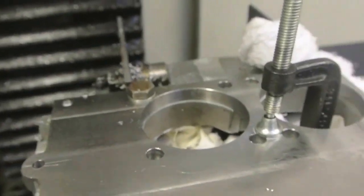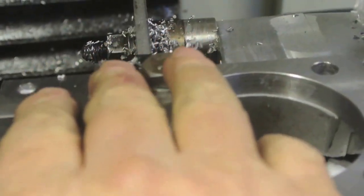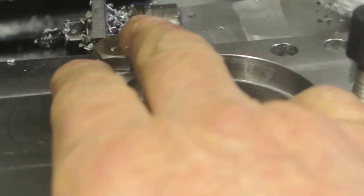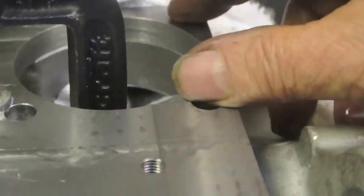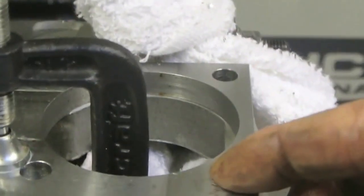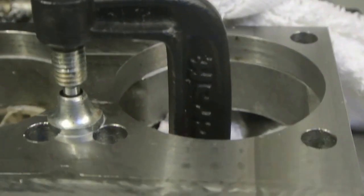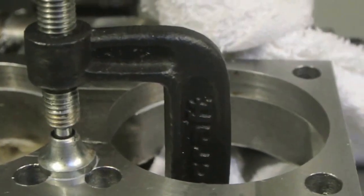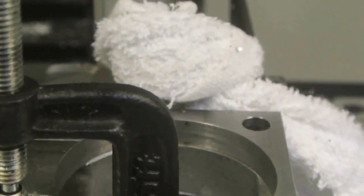Now you can see I've fitted a bolt in this hole here, tapped it while it was in the machine and made a bolt to fit. Next I'll run up this row of holes — I'll do the end hole first, because these end holes are all slightly deeper than the four inner holes. It just means I can keep the same program; I've just got to set my zero to the centre of each hole. I might even try going along and centring each hole.